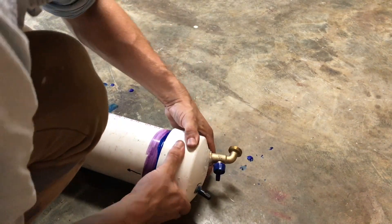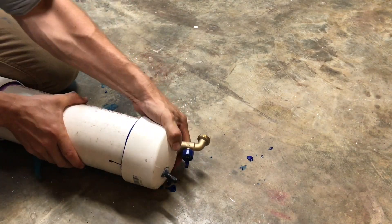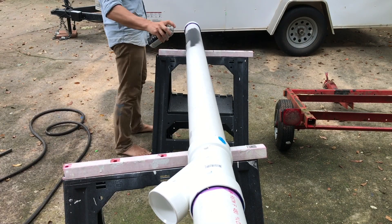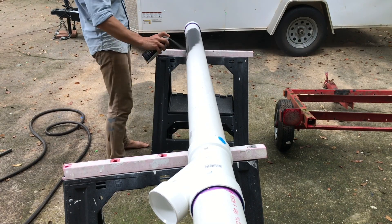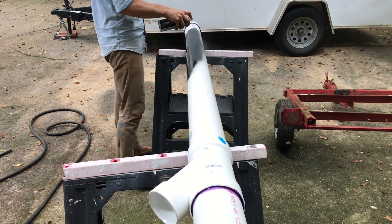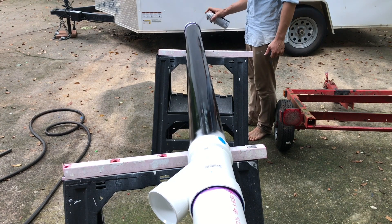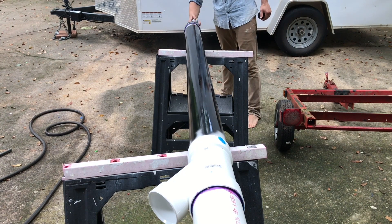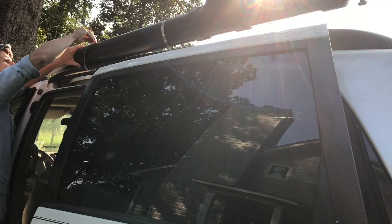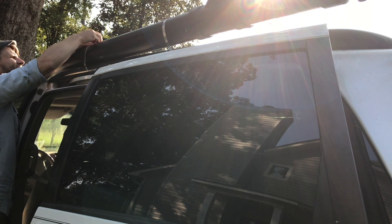Now this is the tricky part — I'm putting this cap on, which is the business end of the shower. I'm going to try to twist it a little bit. Once all that sets and dries and the PVC glue has cured — I give it about 30 minutes to an hour depending on temperature — go ahead and paint it. Use flat black paint, like Rust-Oleum, because flat black is going to absorb the most heat and not reflect it back out.